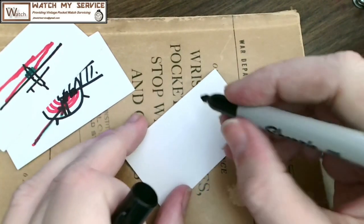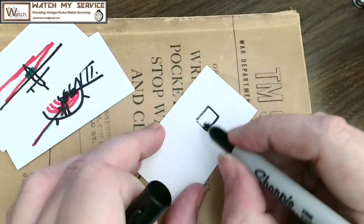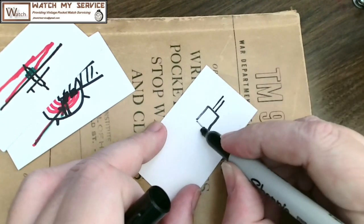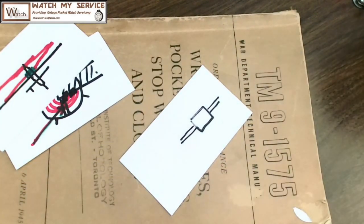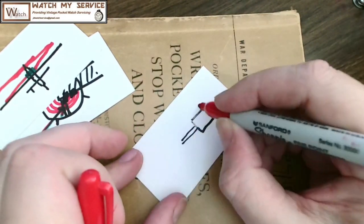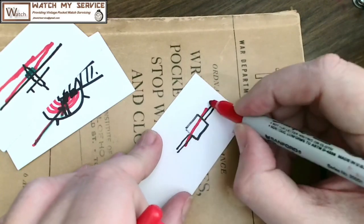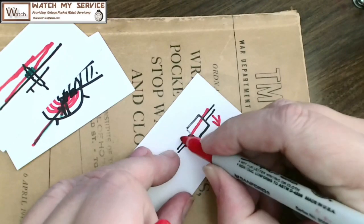Diagram center. So there's the pin, there's the stud like that, right? And the end of the hairspring was here, like this. And the other side was on this side. And then I placed a pin in the stud to keep this in place. And this goes off around to the corner, right? And it goes to the grocery store and back. But when I pinned it like this, I put the pin in like that. And the pin was at a bit of an angle like this. And that caused this to go down and this to go up.